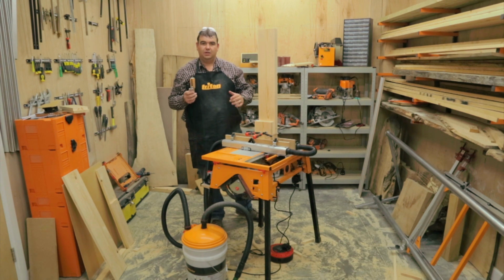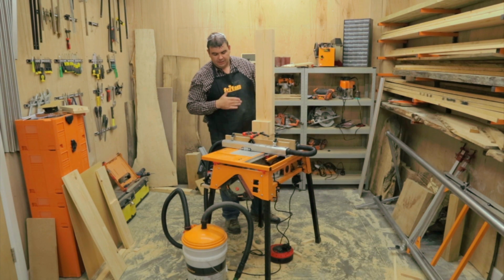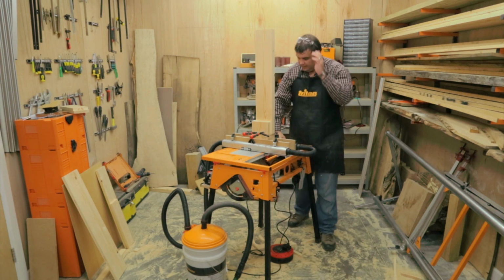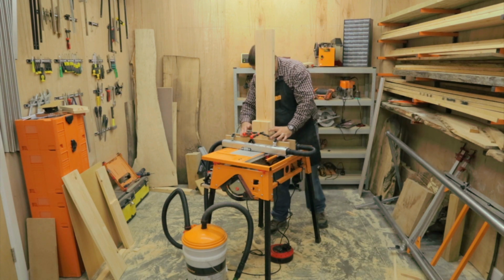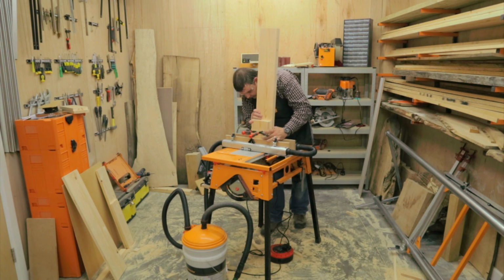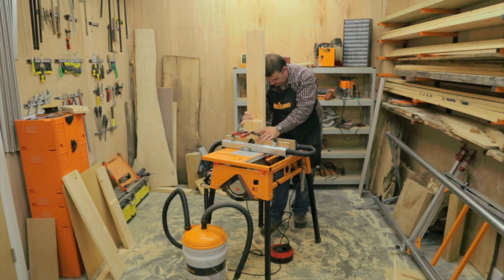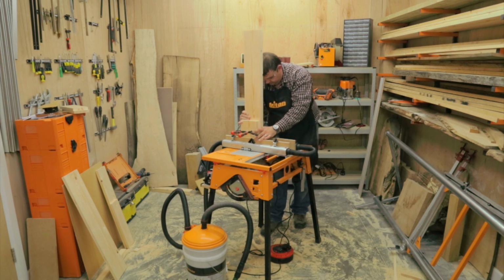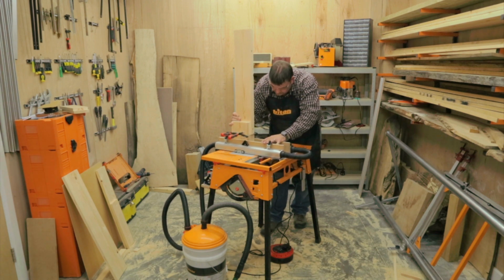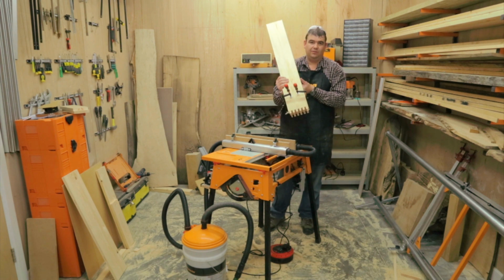So you're only going to use the offset jig for the first cut. Okay. Then there is a spacing finger right the way through the unit. We're going to move this up to that spacing finger, and now we're going to do the following cut. Okay. And then each cut after that as well. There you go. There's your cut. Very, very quick and easy.